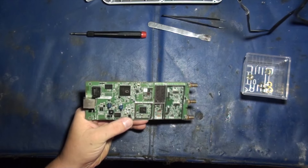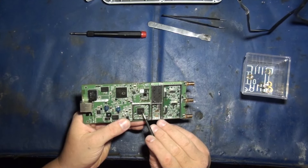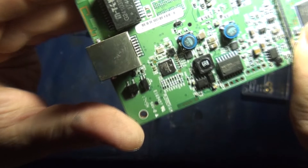Now I'm going over the most important parts of the guts here, because I could go through every little component, but you guys just want to know how this thing works. This guy has its own little internal radio. And this is your Ethernet transceiver chip — it is an Atheros, and it's gigabit. Let me zoom that in so you guys can see it better. That little Atheros chip right there — that is your Ethernet transceiver. It's gigabit.